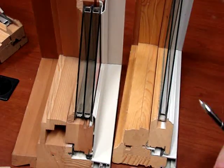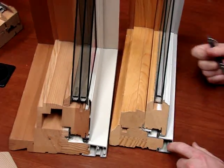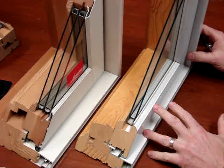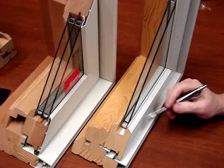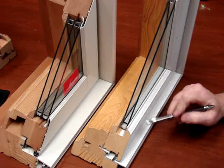They're also able to put a better paint coating on the extruded aluminum versus the rolled-form aluminum. So if both of these windows were in a dark brown color facing south or west, the rolled-form one is going to be two-toned after a few years, because it's made differently and fades quicker than the extruded frame.